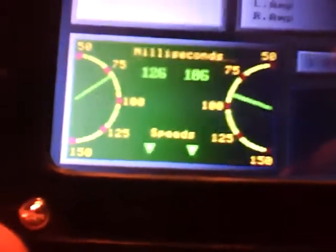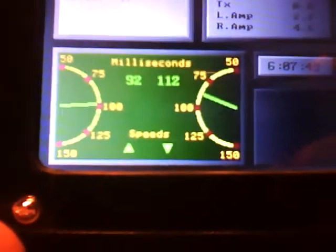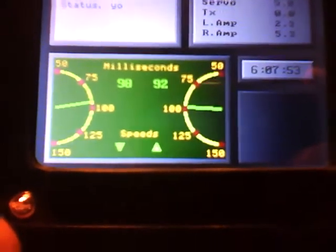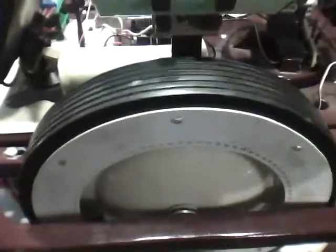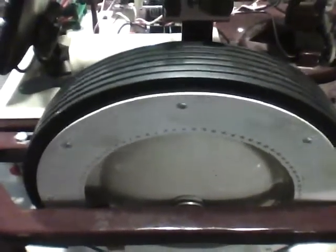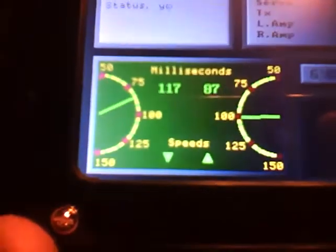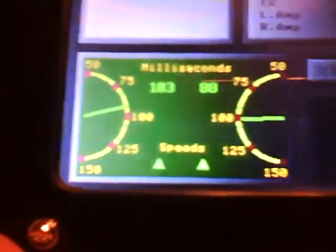In this case, it's 9 counts at 100 milliseconds is 3/4 of a foot per second. And 6 counts at 100 milliseconds is a half a foot per second. So you'll see that's regular speed, and in a second it will, right there, that's the slow speed. Okay, you can see it flow by there. You can see the little triangles at the bottom showing if we sped up or slowed down. Main menu. What would you like to do?